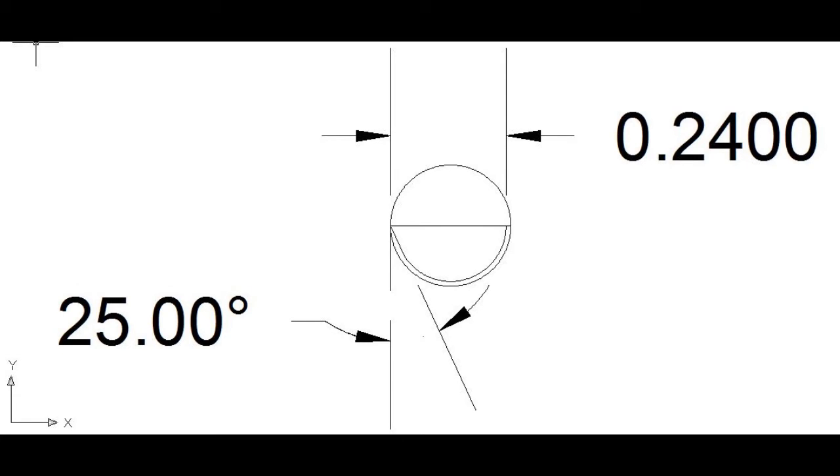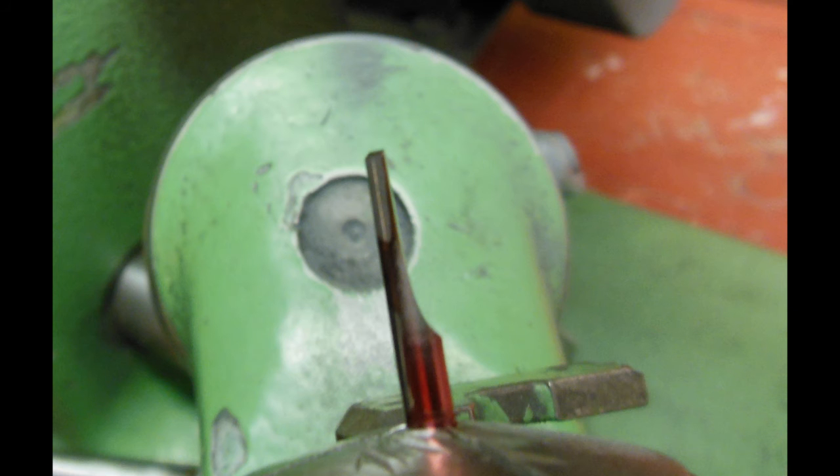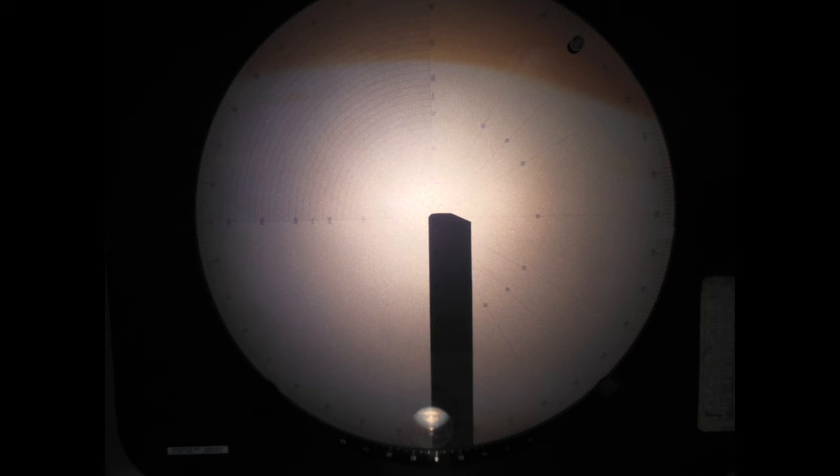Here's a little drawing — that's my 25-degree angle that gives me my cutting edge. That's the actual end mill or cutter we just did, eighth-inch diameter. That's what the relief looks like on the side, and that's what it looks like on the comparator. There's my 8-thousandth radius in the upper-left corner. See you in the next video.